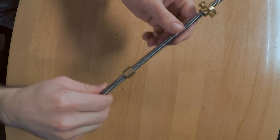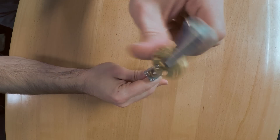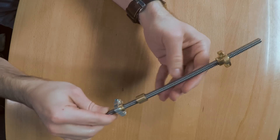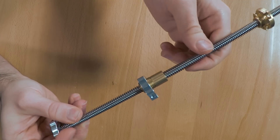Finally, we're going to talk about one of my favorite methods for driving linear motion: lead screws. The lead screws we offer are 8mm diameter, 4-start, 2mm pitch — so every rotation of the lead screw causes the nut or barrel nut to move 8mm. We offer two different nuts currently. One is a barrel nut with a 1.5 inch OD, so you can clamp a 1.5 inch clamping hub or any style of clamping mount around it. The nice thing is you can clock it — if you have multiple lead screw nuts on one lead screw, you can rotate them exactly where you want before clamping.